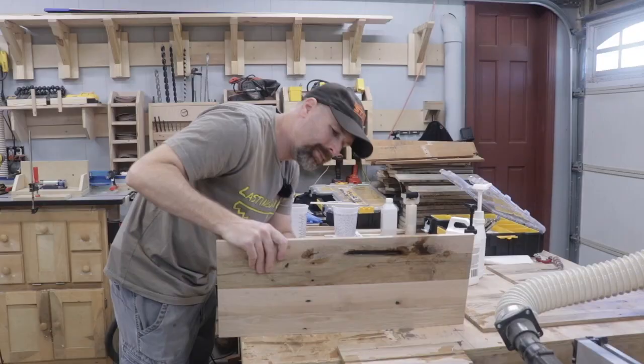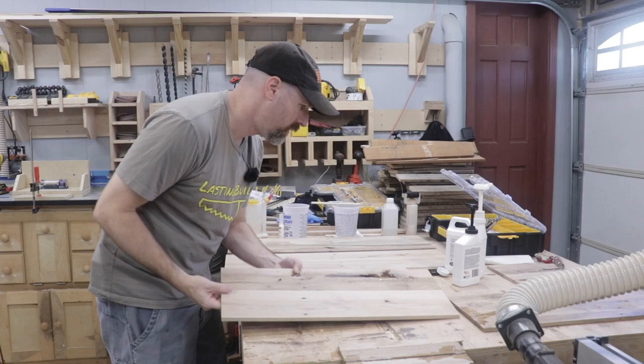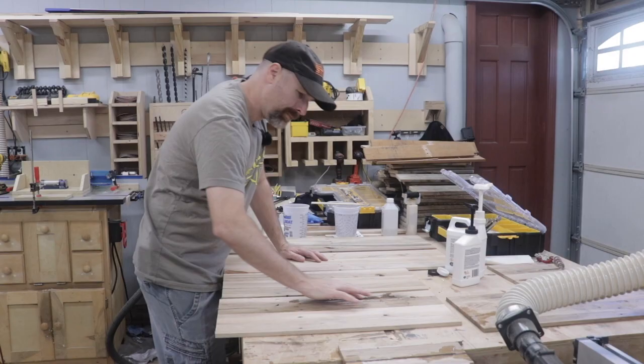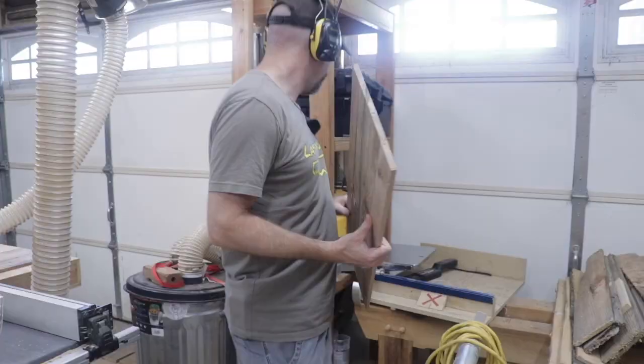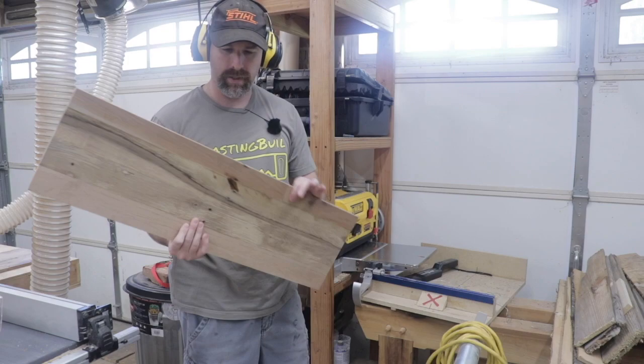I've gotten about 90% of the tape off. One tip I can share from having a little bit of trouble getting the tape off some of these joints is to leave the tails of the tape quite long — that way you have enough to grab hold of and pull it off, because if the epoxy sort of impregnates with the tape, it makes it really hard to get off. So I'm going to go ahead and do a little bit of final planing, just take the top of that epoxy off where it's bubbled up a little bit, and then get all the boards to the exact same thickness. Then we can move on to the joinery.